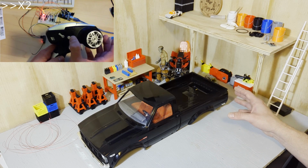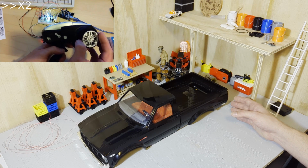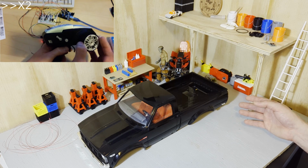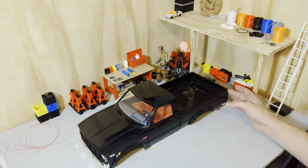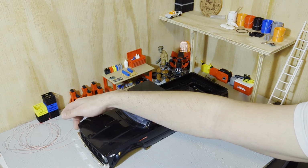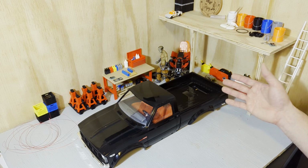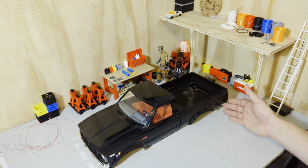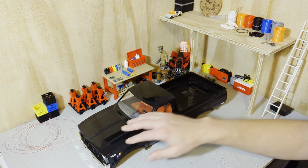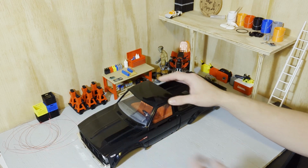So I went into the code and changed it to where the brake lights are dim whenever the park lights or headlights are on. So you can see the tail lights like a normal truck is supposed to have. I have it now where I have a reverse light, signal lights for the back here, and signal lights up front for this one and this one. And we have our tail lights, which are dim whenever the park lights or headlights are on, and then they go bright when they're in neutral, which is pretty much brake for crawlers. As well, I have this one and another one back here, which are your park lights. Same here, park lights. And then there's two up front in the front bumper. Those are park lights as well.